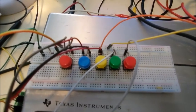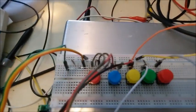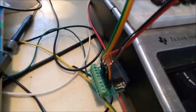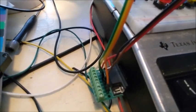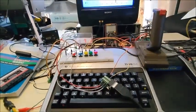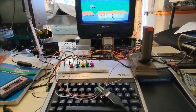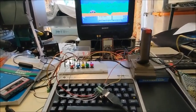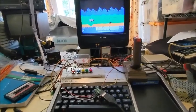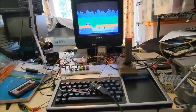The diodes are 1N914s, going to the common for joystick one, and that's going to the other nine-pin breakout that's plugged into the TI-99/4A. Very janky, but it actually gives me the ability to use my Commodore C64 joystick. I hope this was useful — thanks for watching and we'll catch you next time.